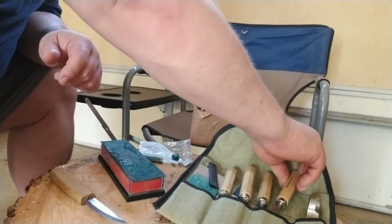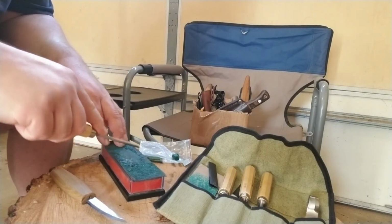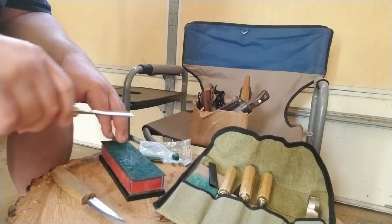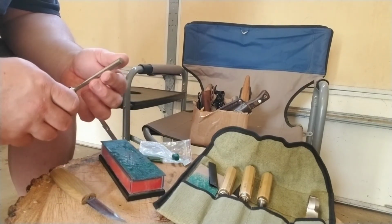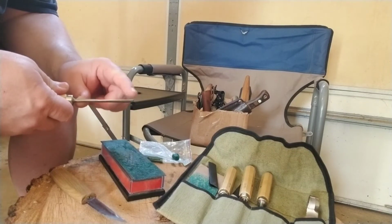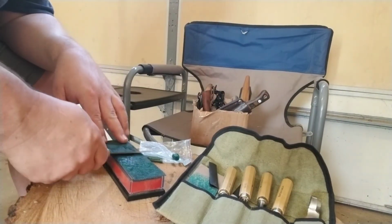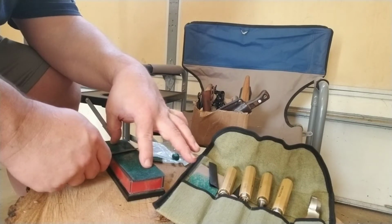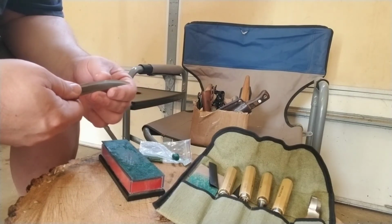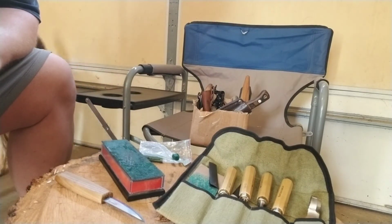Along in the series, we'll talk about other tools. This is a gouge, and you do the gouge the same way. Just pull it across there, and then just like that spoon knife, you want to make sure that you don't have a burr rolled up to the inside. See, with the sloyd, you don't have that problem, because you're pulling the burr from this side, and then you're not developing a burr coming off the back side, and that makes it for a much better usage.